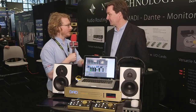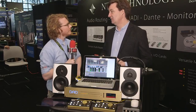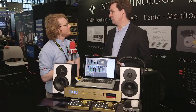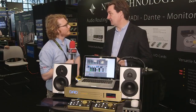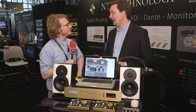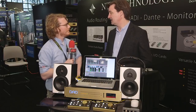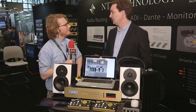What are the new things — the Moms? The new thing is that in addition to the actual functionality of the DAD box X32, we have a monitor control layer we are calling ProMod, and now we are up to ProMod 3. ProMod is a way to say this is my box, which is a monitor controller — you have your inputs, your outputs, making it like a studio control room. This is done by the software called DADMAN, which is seen here, and that can now be remoted and managed by the Mom. The Mom is a little remote controller on the front there, which simply lets you manage the volume, level changing, and source and speaker selections. The cool thing is you can have multiple of these, kind of making a studio system with more locations where you may want to control your functionality.